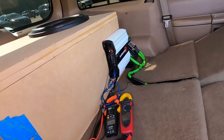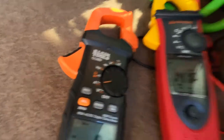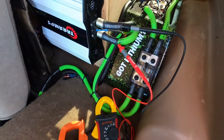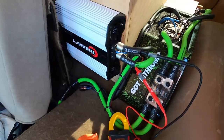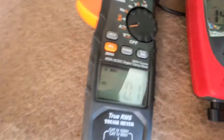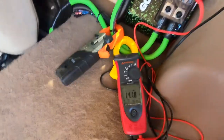This is the other half of the clamp test — the DC clamp test. This is an AC-DC clamp, and by measuring the minimum voltage and the maximum amperage, we get our DC watt pull on the electrical system. Comparing this to the 3,100 watts we found on the AC side, we can figure out the amplifier efficiency. This is set to minimum hold for voltage and max hold for amperage. You have to set the range, otherwise it'll overload. Let's clamp this on and do that same 30 Hertz test.